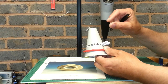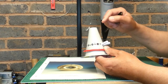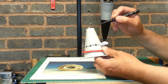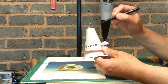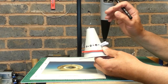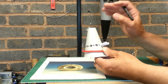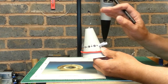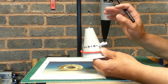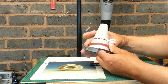Also make sure there are gaps on the outer chamber — there's a saw cut or grind edge to it. I can't remember the exact spacing, but make sure it's clear with a proper ground groove as specified, because that's meant to go in there and it keeps the can from burning away. So that's important. If you've folded them in a bit, it's worth opening the slot again to the correct size, otherwise you're not letting air through for skin cooling to help the can survive.